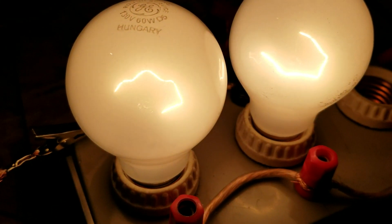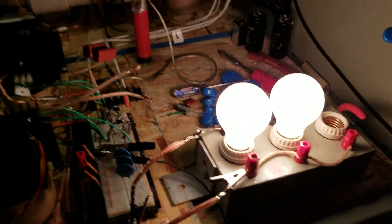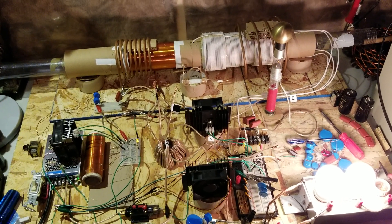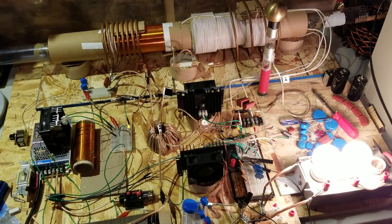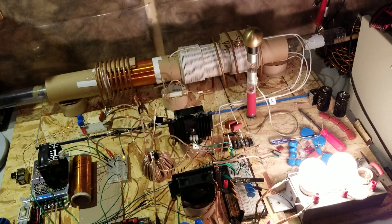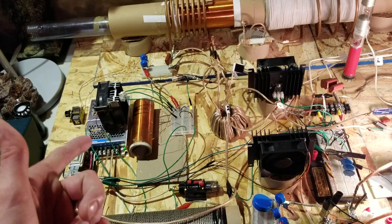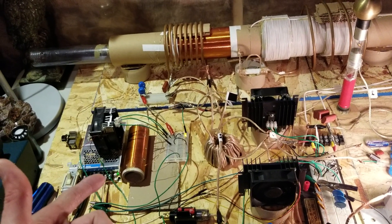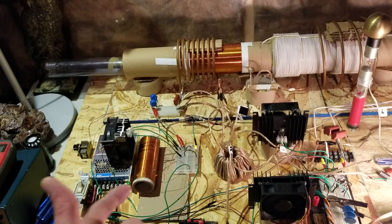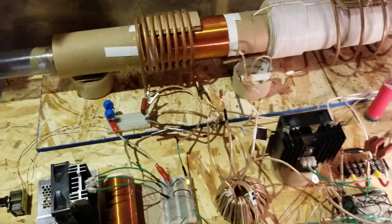Pretty neat stuff. These are 60 watt bulbs with 90 volts across the two lights in parallel. It's supposed to be 115 volts I'm looking for, but 90 volts isn't all that bad. Due to the tripping out of the power supply, I'm thinking I'm going to have to run this right off 24 volts to power these things and see if I can push past this issue.